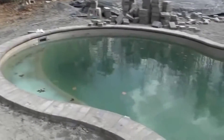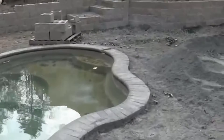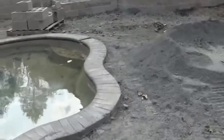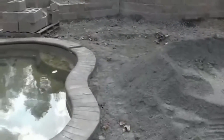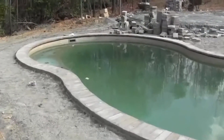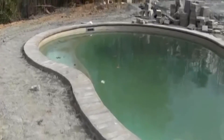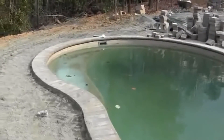Currently you can't see this because the pool coping tiles have been adhered onto this 100mm pool ledge. Please note that the coping tiles used here are approximately 350mm in width, which means that they are only adhered to 30% of the pool. The rest of the coping is simply sitting on top of crushed rock, which is in itself unstable.